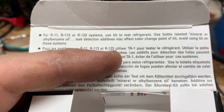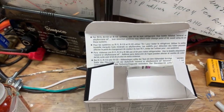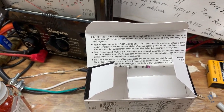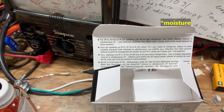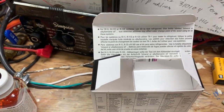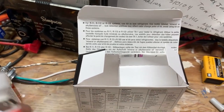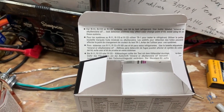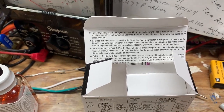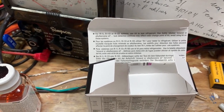Avoid using the kit on these systems. I've had systems where when I poured the oil out, the oil almost glowed — it was very yellow. You can get yellow oil with acid, but when you get kind of a neon yellow oil, usually it's a dye kit. When you're not sure and your customer says they don't use dye, you throw one of these in there and it comes back positive for acid — they're going to get the labor, the time, and materials to have filter dryers put in to clean up the acid in the oil.